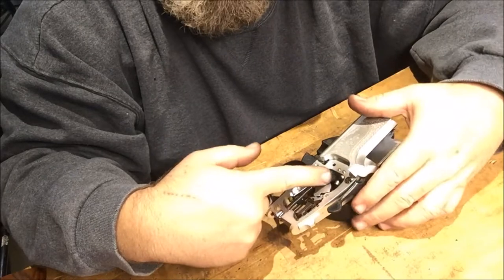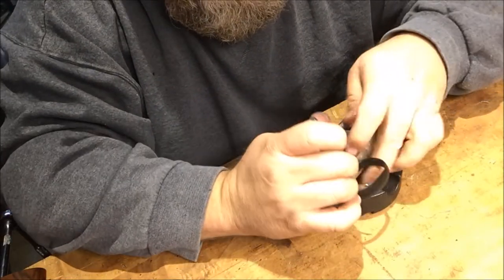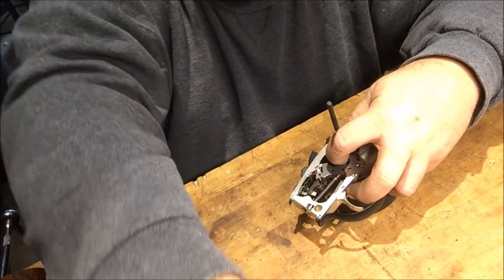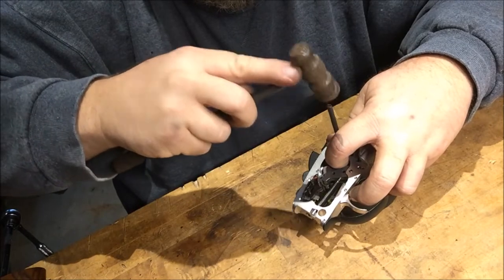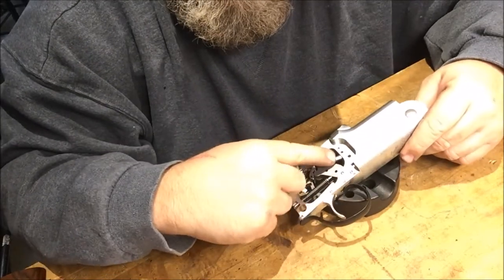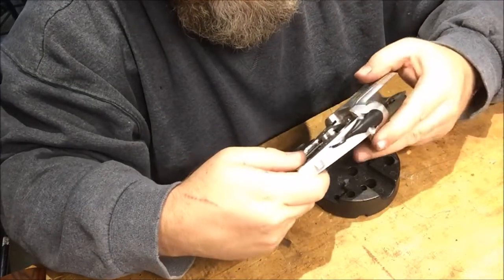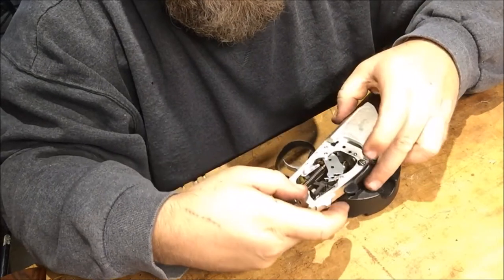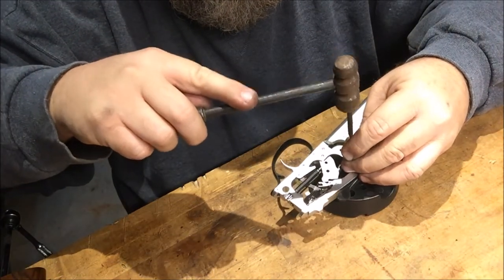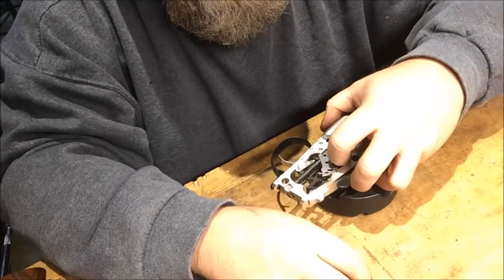The next thing you want to do, you've got these two firing pin cross pins — you want to knock those out. Once I got it almost halfway through, I'm just going to push it on out with the pin, just relieving the firing pin now. Don't want to pull it out or anything like that. Now we're going to take the other one down. I'm going to flip it over here so I can hold on to it with my finger. Once it gets started, just cover it up with your finger and pinch it on out.